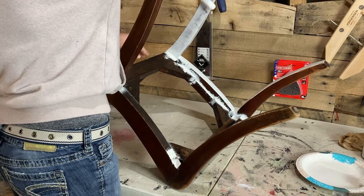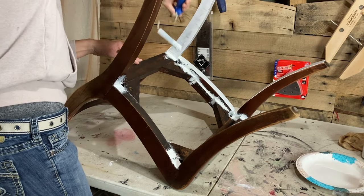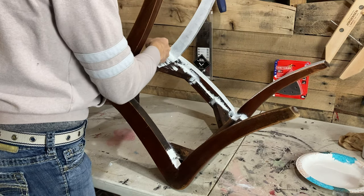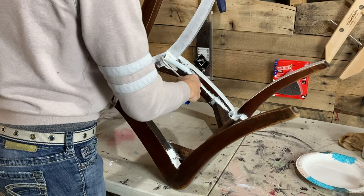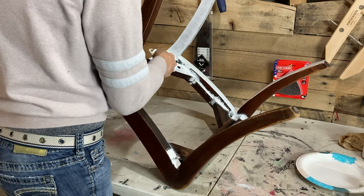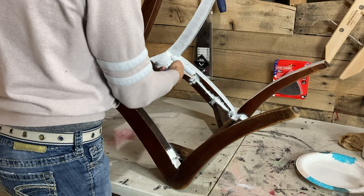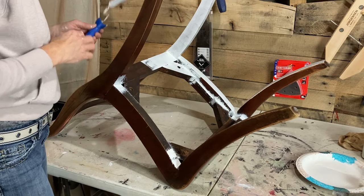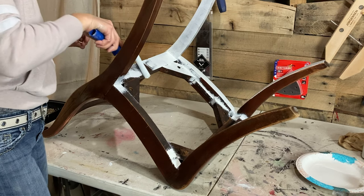And you can tell how thin I'm putting it on because I don't have the roller totally saturated, how I still have to work it on so that things aren't dripping and oozing over the edges, causing all sorts of run marks and stuff. So I'd rather go over it several times in thin coats than to have to worry about drip marks and run marks or lines left by the roller's edges.